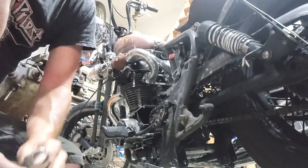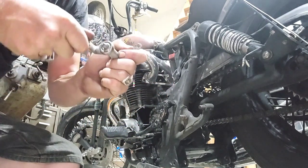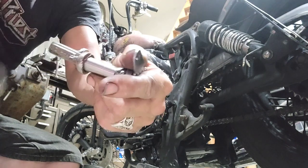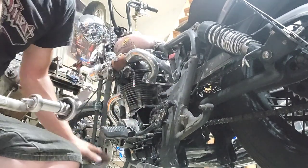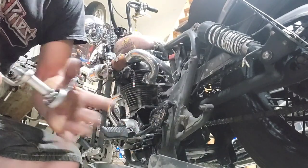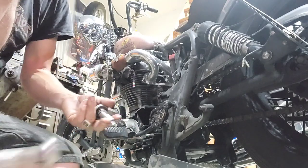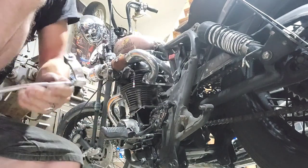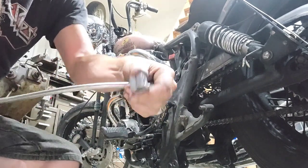Now you're asking: how do you rotate it? Well, from the previous video I showed you I made this arm. You can use any fitting thing really, but this right here will press fit onto the shaft — you've got to kind of drive it on. I may put a flat on this, drill it, and tap it for a set screw — that would work. I could tack weld it on, but if I weld it, you've got to cut the weld to get it apart because it will be captured within the housing. So keep it serviceable.